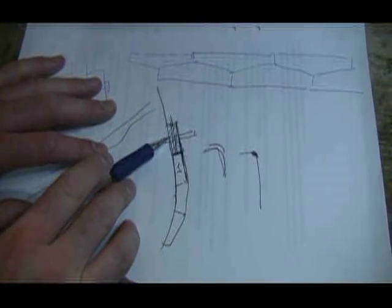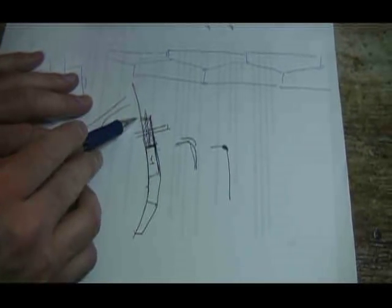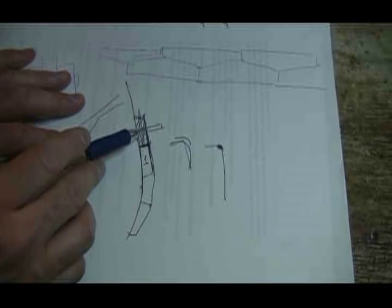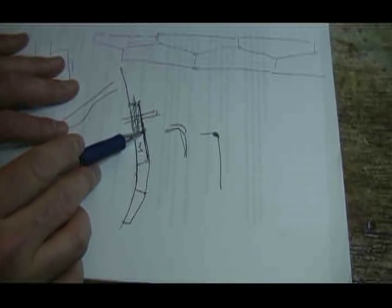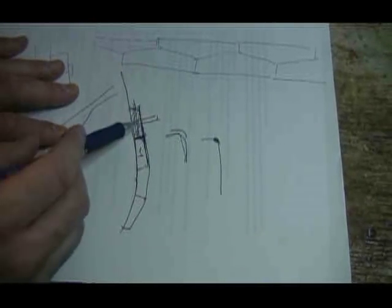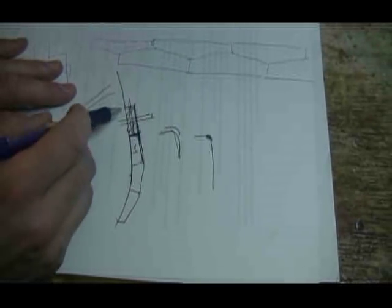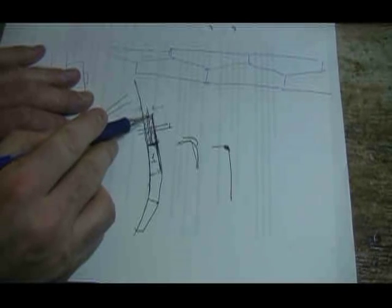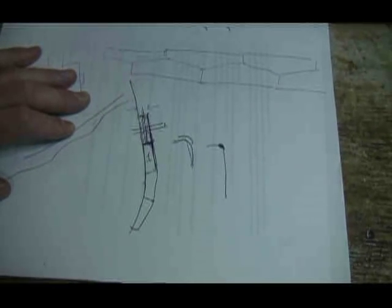And if I could just go back to one other thing. This is the diagram we were looking at earlier. I'll just explain it because I didn't get a chance. This is the side view. This is the plastic template that he inserts with a wooden nail, no glue. And these are the planks that he then adds later. One of the reasons for inserting this is he can push these planks up flush, and when he sands it later, this will prevent this plank from being sanded on an angle like that, which gives obviously a horrible result. You can also paint this template with red paint to make sure that you're not sanding too much. He's also suggested that the depth of this plastic template should be equal to the required depth of the plank, so that you can match everything very easily in terms of depth.